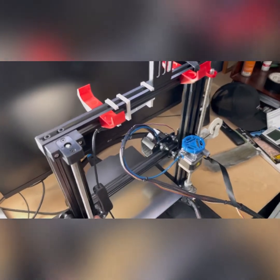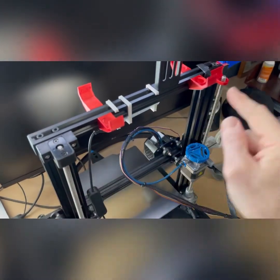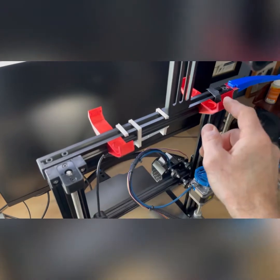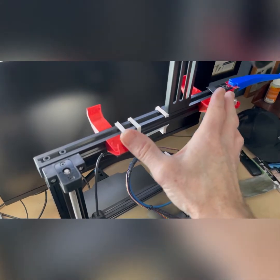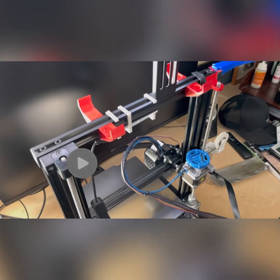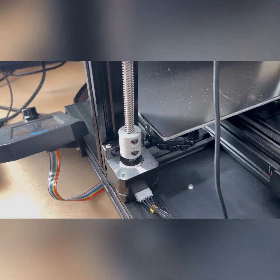However, I found another kit which replaces the screws with slightly longer ones and adds a belt on the top. The reason I didn't do the belt before was because I had a filament dryer box sitting up here and it wasn't too hard to level with a block. Since we moved the printer and we're not using the dryer box anymore, we're going to install the belt on top.